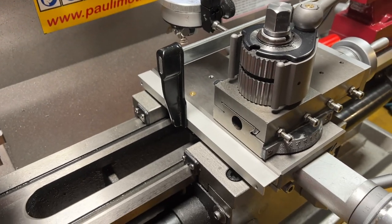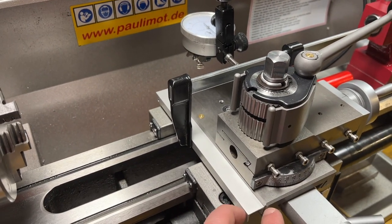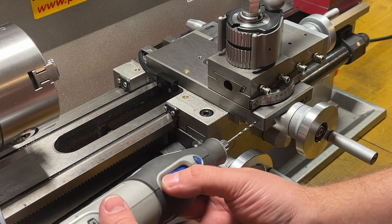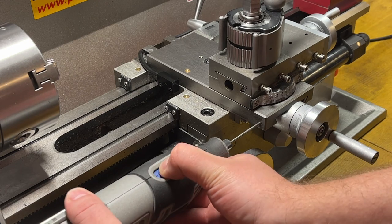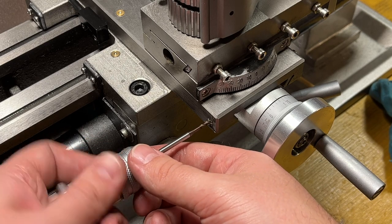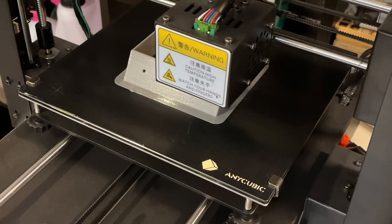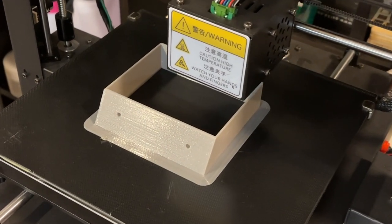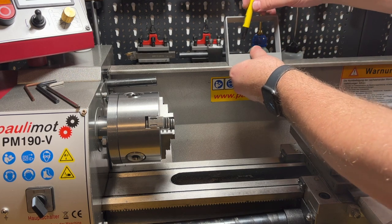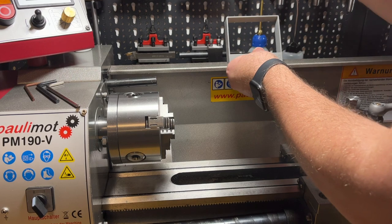So this will be the setup for the scale on the compound. The next step is to drill the holes for the screws and mount the scale. While I am mounting the scales, the box is almost done, and next will be the mounting of the display. I will mount it directly on top of the bracket, somewhere over here, and now I need to form the mounting point.